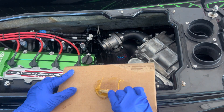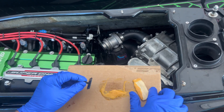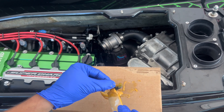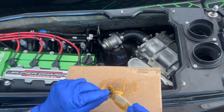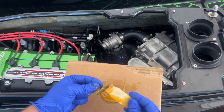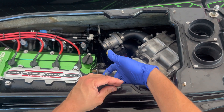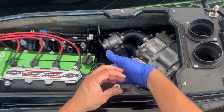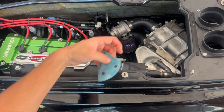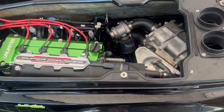I'm doing it because I have it and I want this epoxy to be slightly thickened. So here is my thickened epoxy. You're going to take your mount — your stud mount right here — and we're just going to put this epoxy on the base, just like that. I'm going to coat the whole thing so that maybe that'll prevent salt water from getting on it. Then you reach under here, and while that's through, we're going to take this thumb nut and tighten that. Take some 80-grit sandpaper, roughing up the backside underneath this.